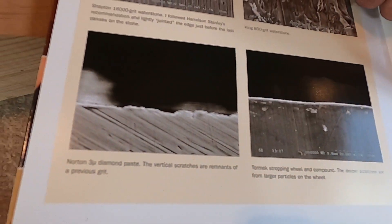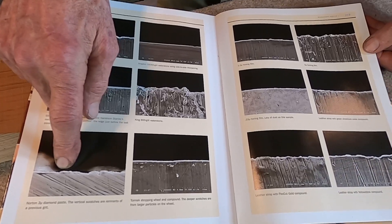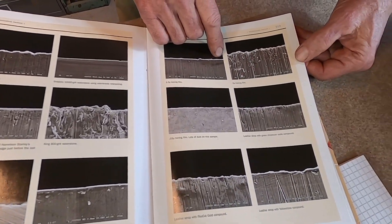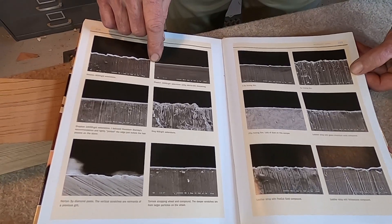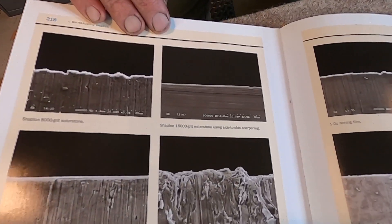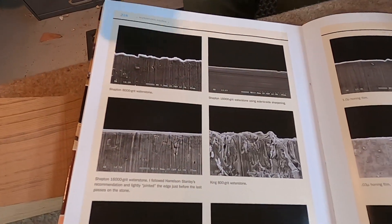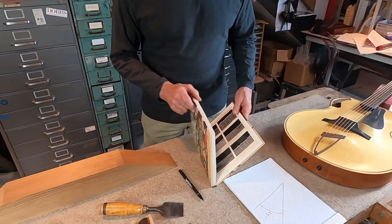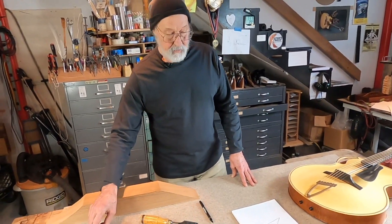You can see the wide variety of results he's getting. When we think about these edges that he's photographing, not all of them are straight lines — some look pretty craggy and jagged. For edge tools and fine work, we really want to create a beautiful straight line of molecules and a polished surface along that edge, so that we have a nice strong edge with all the support we can get to enable the edge to be long-lived. We'll get into that in great detail in a further segment, but there are some things about sharpening I've discovered that have helped me greatly that I'd like to go into.